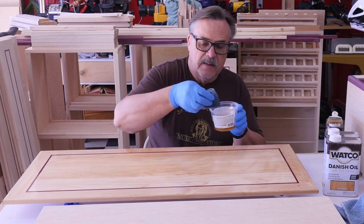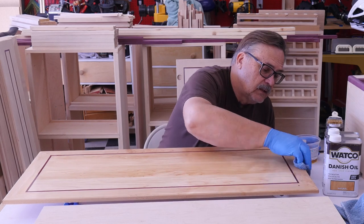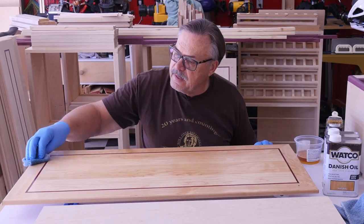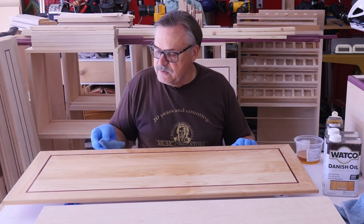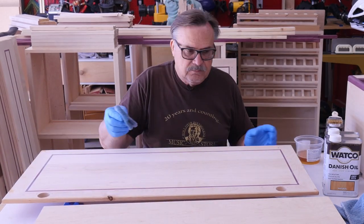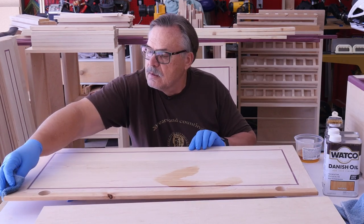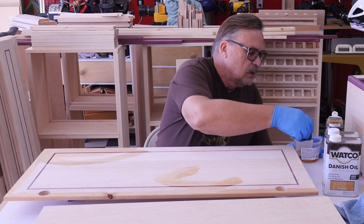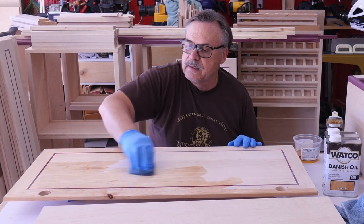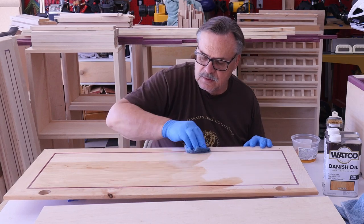To be honest, I don't wait the full 15 minutes, but I'm using oak, maple, and purple heart. If you're using oak or walnut — something that's a little more porous — you definitely want to flood it a little bit more. The issue you're going to have after that is when you go to wipe it down. It tells you to let it soak in and then go ahead and wipe it down. I'm doing the front first and then the back second, and then I'll flip it back over. You want to keep the surface wet, and when you apply it and let it dry — if you let it dry too much — you'll get some spots where it's not quite a good finish, though you can reapply. And in parts where you flood it too much, you're going to get some seepage.